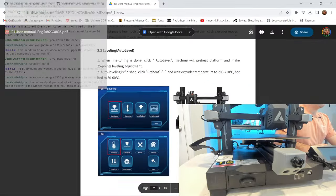So I have a feeling they're all just flashed the same way. So I don't think we could have done anything much different. Yeah, this is STM32F407. That's not what we have. We have a 103. Yeah, I just think I'm doing something wrong. We'll figure it out though. F103, and this USART PB11, PB10 we use. We did 28KiB.